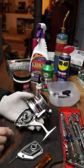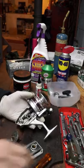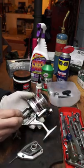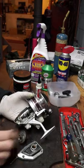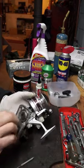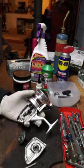And then you have the gear drive, and the main gear comes out, and you can see there's a bushing behind there, which just popped out as well. So that takes care of the innards. On the inside of this one, you'll also see the second bushing on that drive side. So let's get the spool off now.